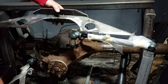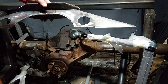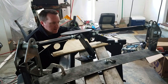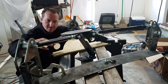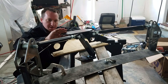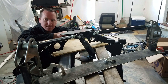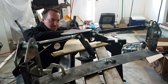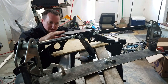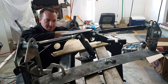Overall the bat wings are looking pretty good. A few things not working out — cutting a circle with the plasma cutter freehand left a bit of a mess, so I've got to decide if I'm going to clean that up. Got my cutting, welding, and grinding done. You can still see the bat wings on the sides — that's what connects to the axle. I also added this top plate, which worked out quite well. It's a quarter-inch plate of steel and actually connects all the various pieces with some nice solid welds. I took my time on this piece because I wanted each of these brackets — the bat wings and this top section — to have really solid welds between them. The best way to do that was to work in steps; as I went up I was able to really get the welder in and connect it together.